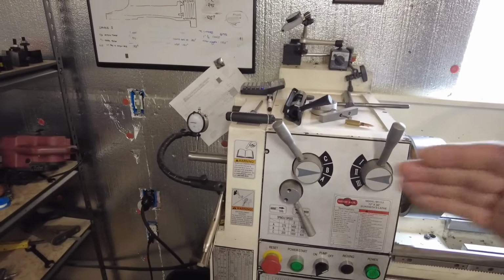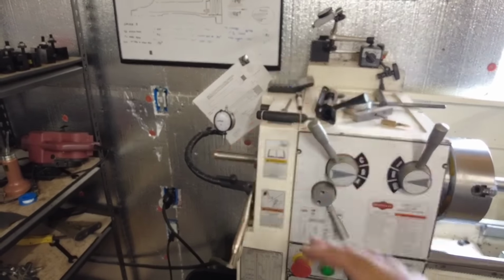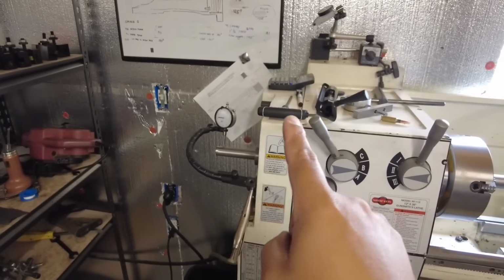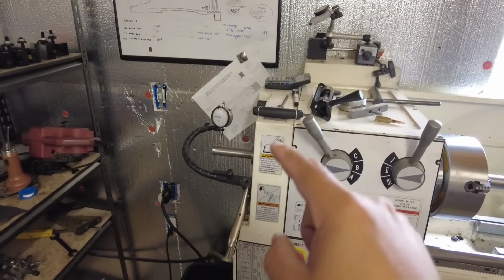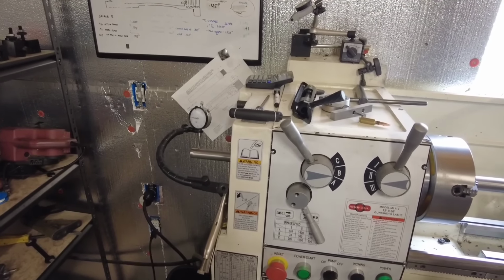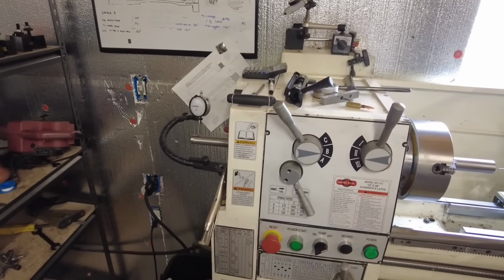I've noticed when these curvatures are at 3 or 9 o'clock, you start fighting striations and deviation when the barrel warms up. You start seeing your groups open up horizontally. You'll get horizontal deviation. So this is kind of a bench rest style of chamber job. To find the curvature, this is what I do.